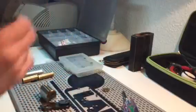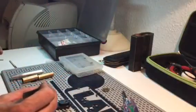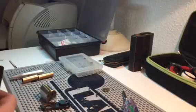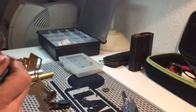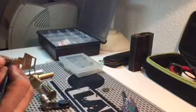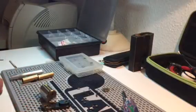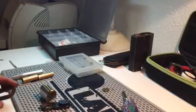With the Ruko 600, the largest gap you can have between two is 5. So if you have a 1 here, you can't have more than a 6 on the next one. Otherwise the angles will be wrong and you will not be able to pull out the key.